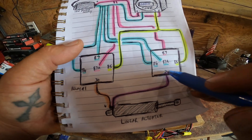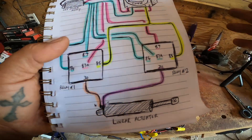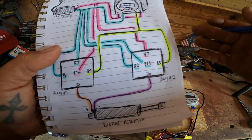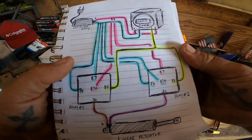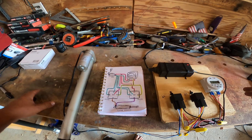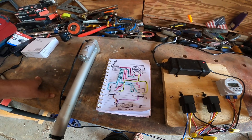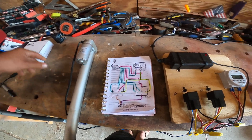After that, your 30s are all that are left on your relays — just connect those to your linear actuator. If you put this all together and the actuator goes outward when it should be coming inward, just reverse those wires and it should correct that issue. That's pretty much it. That should get you from point A to point B — it's a pretty simple setup. If you want to understand exactly how it works, I'll go over it quickly.